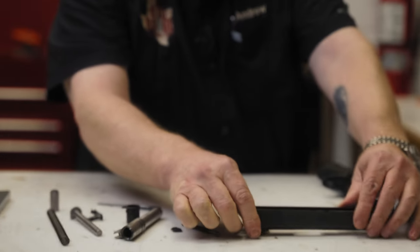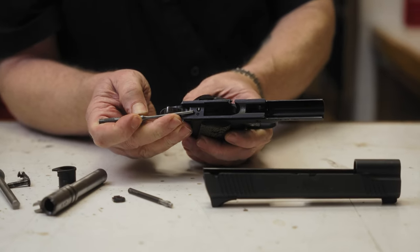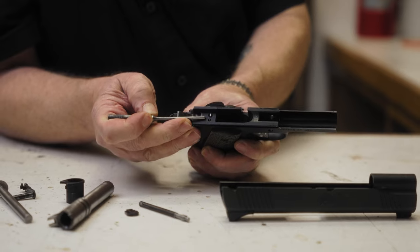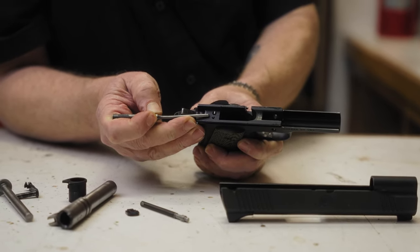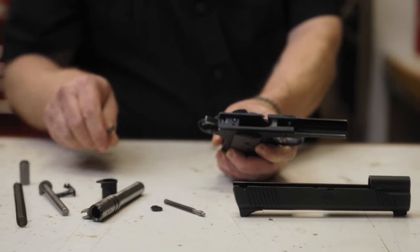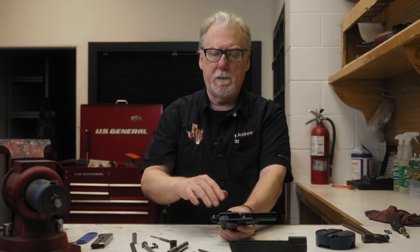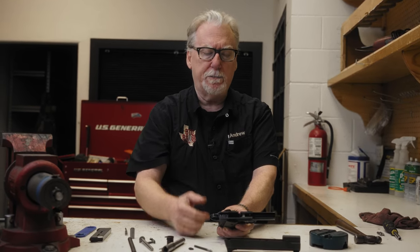What's pushing that up into the slide is this little lever right here. That lever is activated by depressing the grip safety — when you depress the grip safety on the Kimber 1911, this in turn pushes up on that firing pin lock in the slide, clears it out of the way to allow the firing pin to go forward. Now that's different than the Colt Series 80 system. The Colt has two levers: one operated by the trigger, and that interacts with a lever mounted in the side of the frame that levers up and pushes the corresponding firing pin lock in the slide. So on the Colt, the firing pin lock is activated by the trigger pull, but not so on a Kimber — on a Kimber it's activated by the grip safety.